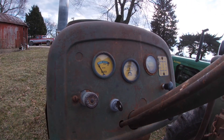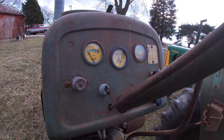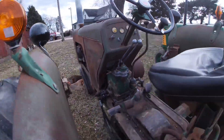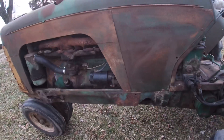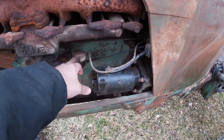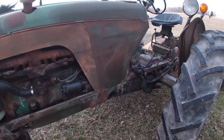This one even has the original gauges — I'd say at least two are original, if not all three, and if they were replaced it was with original dealer parts. I will need to put a temperature gauge in though because it's not connected, and that's important — you can save an engine if you're watching what's going on. The previous owner even put an extra sediment bowl in before the carburetor. It's a nice old tractor and completes my lineup of supers.